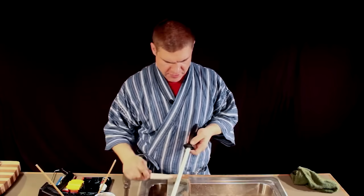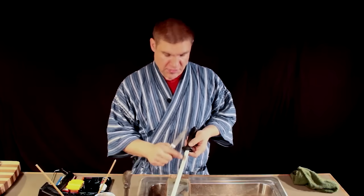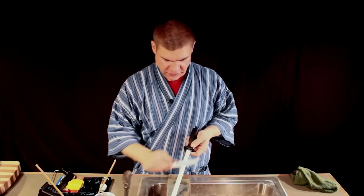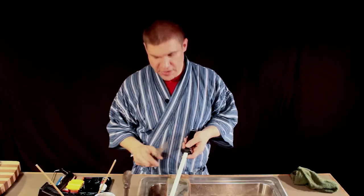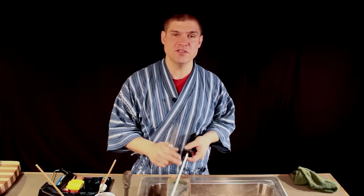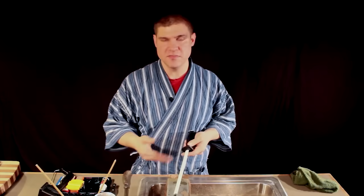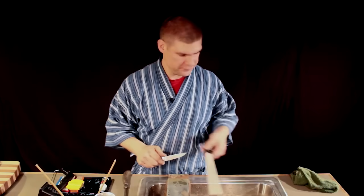And after they load up, they don't cut very well anymore, because basically the little pores in the abrasive have filled up with steel. So you've got two sides. You fill up this side, then you fill up this side, and basically you're now out of commission. There are ways that they recommend that you clean the ceramic out, but it's so time consuming and so labor intensive that it's just not a very good bargain. If that's all you have, then you can make the most out of it. And you'll always make the most out of it by stropping backwards.